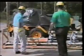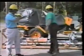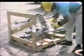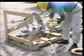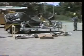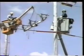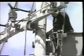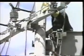This will help balance the switch and help it lift fairly straight. Once tension is put on the line, unbolt the switch from the crate. Tie a hand line to one of the outside phases of the switch. This tag line will help you control the switch when it is being lifted. Slowly lift the switch out of the crate and up to the top of the pole for mounting.